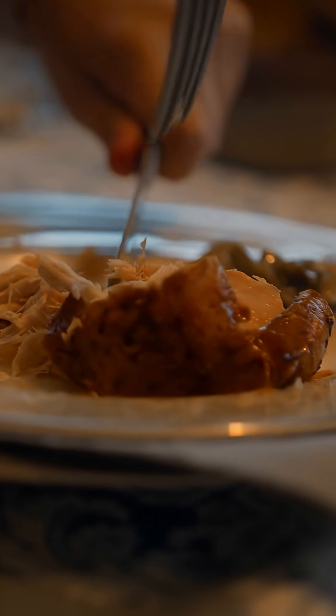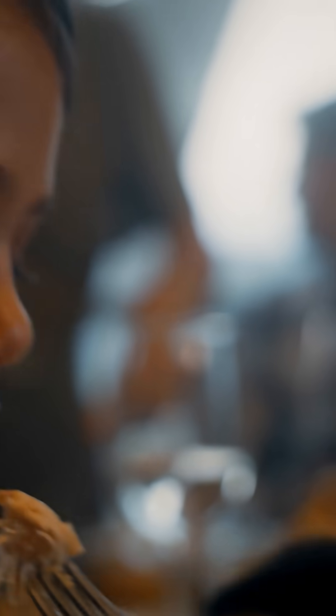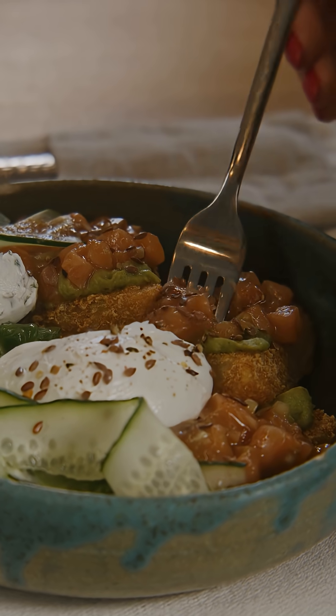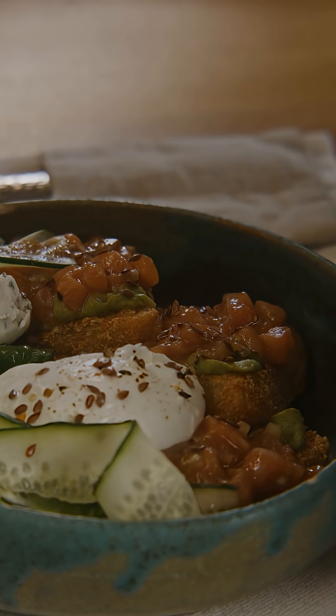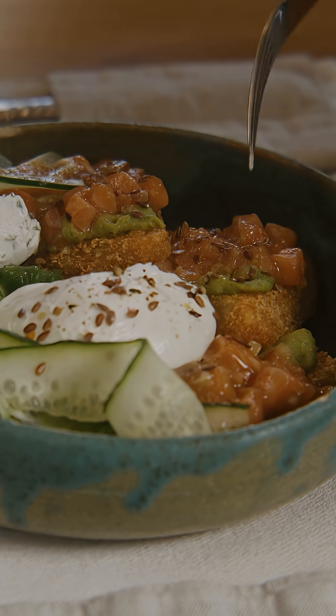If the thickness is less than about 2.5 mm, the tines will bend under normal finger pressures — around 30 to 45 newtons — or buckle under the lateral forces applied when cutting and lifting food. These engineering findings form one of the foundations of modern fork manufacturing standards.